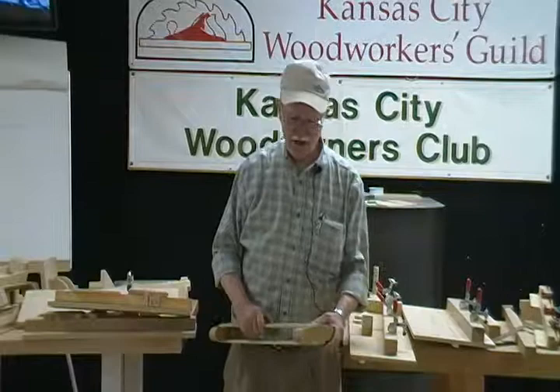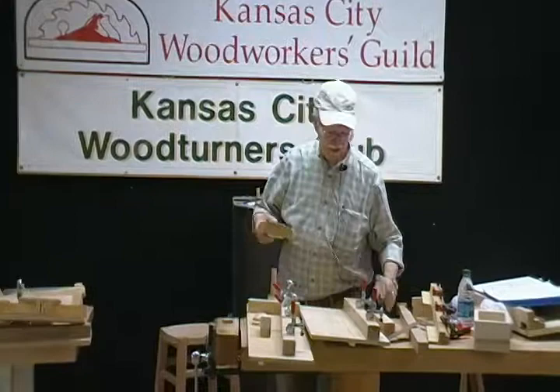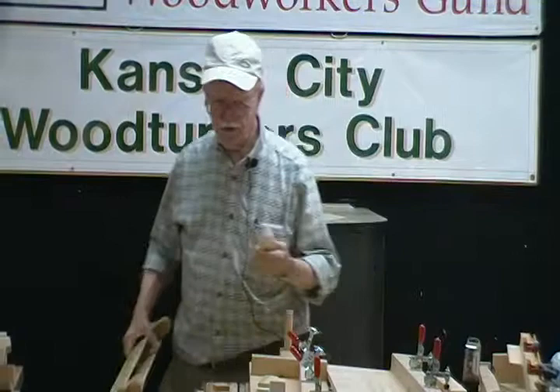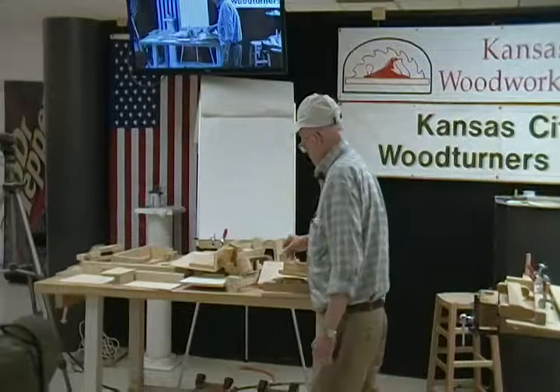The way we do it to speed up production is to stack 20 of these blocks in this jig right here, clamp them down, and take a three-quarter-inch roundover router bit. We run this jig with 20 of them this way, turn around and run them this way, then flip them upside down and run them this way. Pretty quickly we can make several hundred of these and uniformly round the ends. That is a profile jig that allows you to stack multiple parts and do the same operation on the protruding edge of all of them.